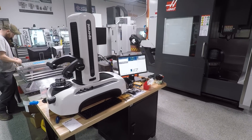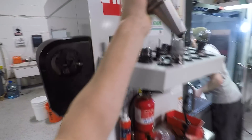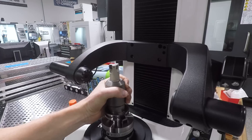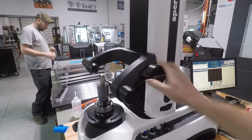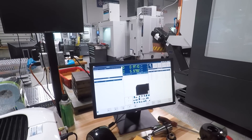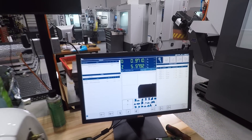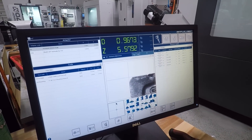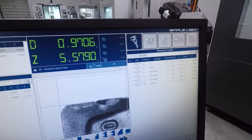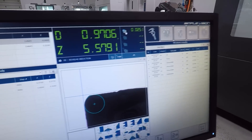Last up is the pre-setter. I've had my eye on one of these for over a year — it's amazing. The classic use is you take a tool like an end mill, put it in here, lock it down, and you can jog over to measure it. Those crosshairs give you very accurate gauge length as well as diameter. But there's so much more you can do with it — you can rotate this little knob here and turn the black-and-white view into a 45x microscope. In this case, you can literally see the damage to a particular insert and where it's been chipped or fractured from use. You can also just click a button and it immediately picks up the corner radius of your insert.